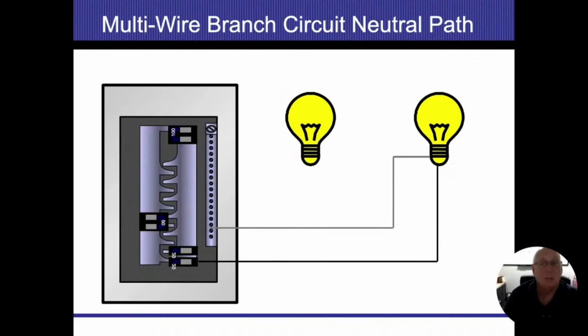So we're going to have another light bulb that goes on there. We're going to hook that up to our opposite breaker. I also want to take a moment here and talk about that staggered bus bar that we're looking at inside of our panel. You can see that the bar on the left is taking power off of the top breaker. The bar on the right is taking power off of the bottom breaker. And I'm talking about the main disconnect at the very top of this diagram.